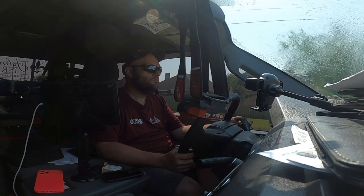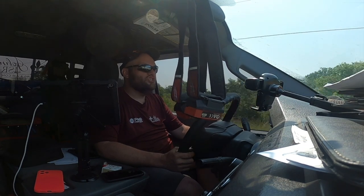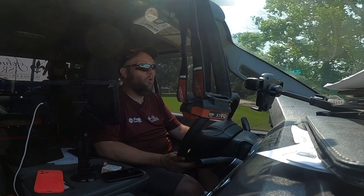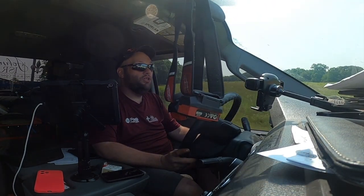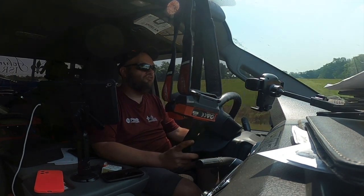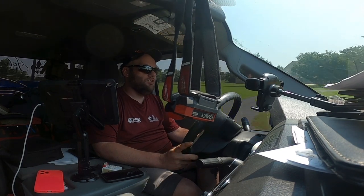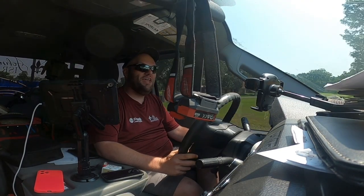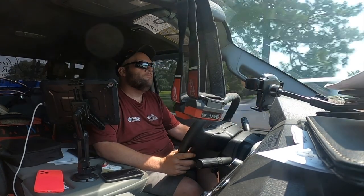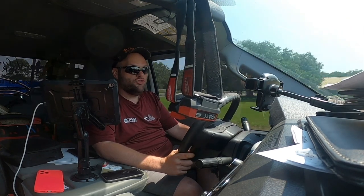Anyway, it's probably going to be Tuesday, but she's got that other system that I just put in, so she'll be okay. That's actually enough air to cool the whole house. She added on an addition, and I don't know why they put a ton and a half system. It's too big. All that really needed to be done is bump up the Rheem system that I put in to a 3.5 and tie the ductwork into it, and it would cool the whole house.